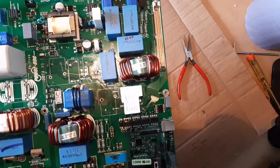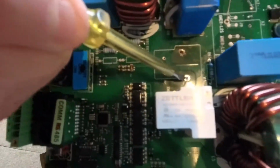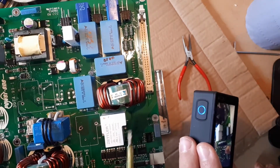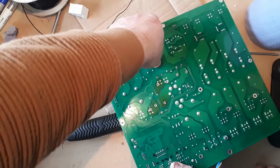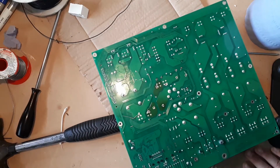Right, we've decided that we're going to solder these relays in one by one. So what you can see is we have this extra piece of wire coming across to bridge the track. That's definitely going to help. That's going to take some of the stress off of the circuit board, and also it's going to help the via. You can see I have a tiny little piece of wire popping out of that side. I don't think that's worth worrying about, I really don't. And the coil wires are popping through fine as well. So we're going to flip this over so that we rest the relay quite solidly on, and that is nice and poked down. So at this point I think we are ready to make some soldering.